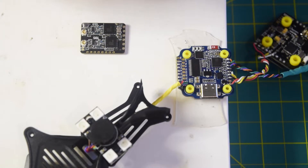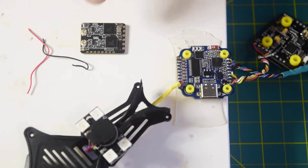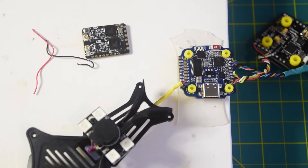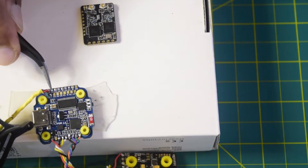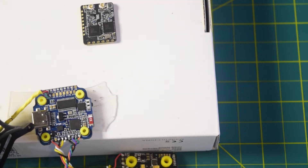These are the colored wires I have. Red and black will be used for power, and then I will use other colors to connect to the different ports. Let's start soldering — first the red and black to power this up. My 5V is the first pin here, and this one is ground.